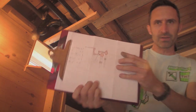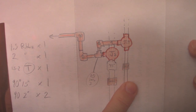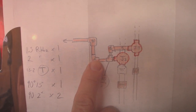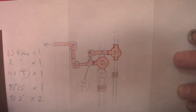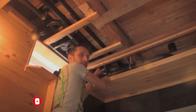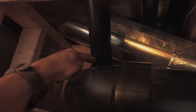This is the ultimate design I'm going to be working on. I've got it sketched out right here — this is the two-inch pipe and this is the one-and-a-half-inch pipe. I'm going to be adding the two valves, they're going to be splitting off and then joining each other and going outside with a series of bends. My left and right on the view screen is backwards so I keep pointing the wrong direction, but they're going to go outside the wall that way. The stuff in orange is what I'm adding. The two-inch valve is going right up in this area — water comes down, branching left brings it out to the greenhouse, and going straight brings it into the septic.